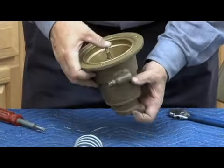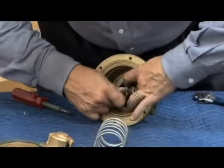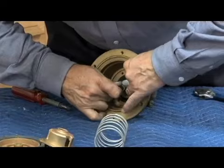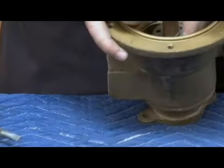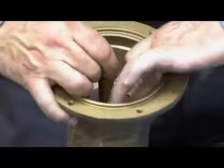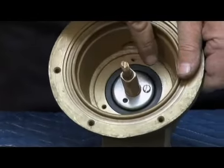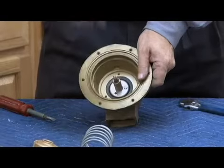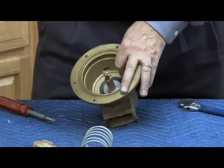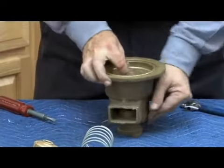Now what I want to do is go ahead and move my relief valve stem up, folding the rolling diaphragm down on the outer lip. What that does, that lip side has to go into the recess. Pushing it into the recess, once I have the diaphragm in its shape, now I can push down, and that'll make sure it's folded just like that. Very important that rolling diaphragm be folded all the way around. So you pull it out, put the outer lip in, push it down, the center will collapse in the center, and that'll line up the relief valve stem.